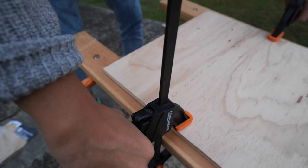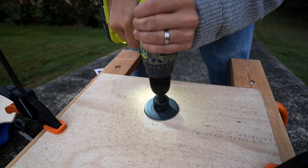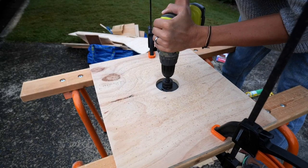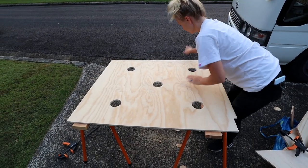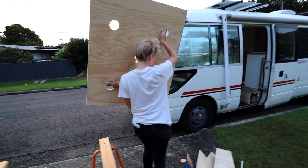We are finally getting to the point where we are finishing off our bed. You might wonder why we're making holes in the actual bed frame. The reason we're doing that is because it helps with moisture and damp. By creating holes in the timber that will sit beneath our mattress, we are doing ourselves a favour. We're sanding all the edges down to make sure it's nice and smooth, and then we'll start fixing these down into the aluminium itself — and putting on piano hinges for the sections we want to hinge open for storage. It looks like a big dice — you've just rolled a five.